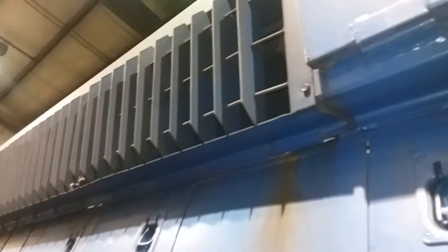The dynamic brake resistor grids are set at 700 amps. I'll show you where they are on this locomotive — they're in here. That's what dissipates the heat. There's also a bank of these on the other side of the locomotive as well.